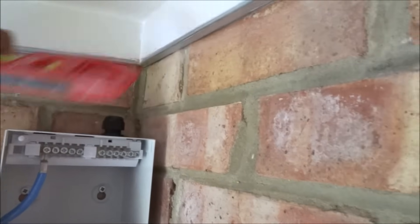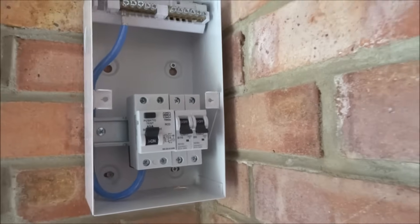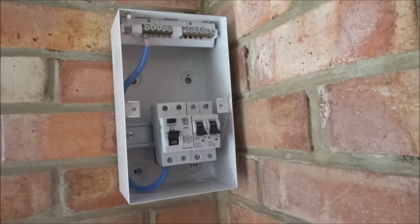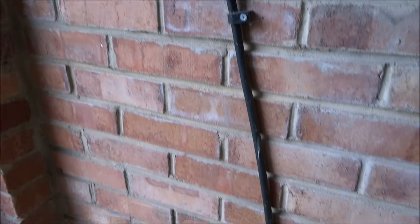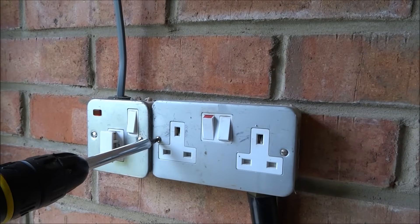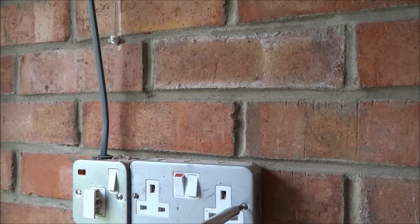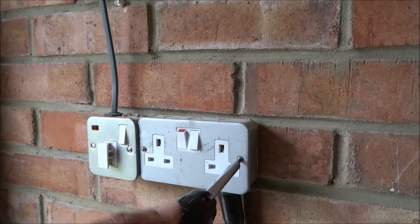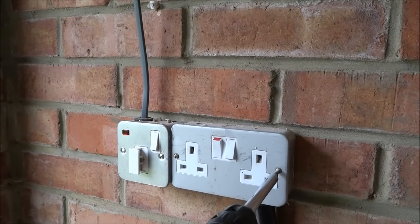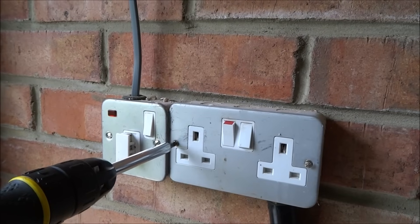It's leveled up and you can see the gland fitted. I'll get the second gland in shortly. With the fuse box on the wall, I've isolated the power going via the cable and I'm going to open it all up. Safety is critical here — be 100% sure you know how to isolate the supply. The last thing you want is to kill yourself, so I am 100% sure this is completely isolated.